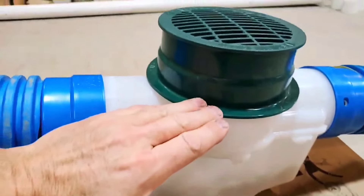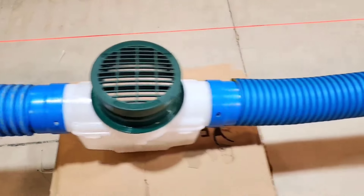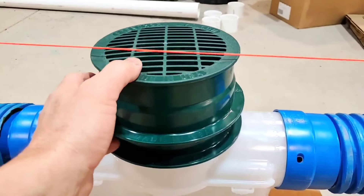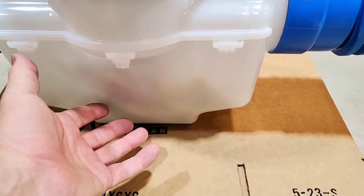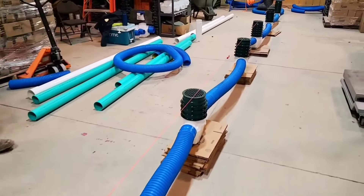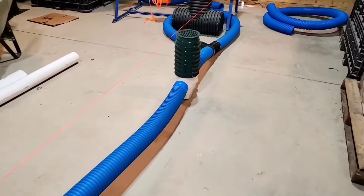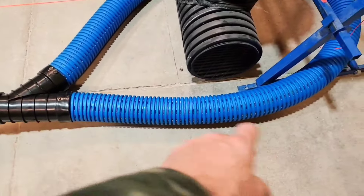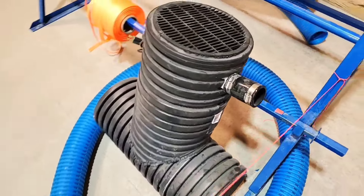This is how you're getting your slope — you have a flat yard and this line represents the height of your lawn. You've got water laying there and you're trying to get it out. You're dropping the water in the 6-inch inlet basins where you're collecting all the sediment so you don't plug your pipe, then running the water on a 2% slope. Right here you're discharging it into the sump pump area — perforated 8-slot, loop it around with a Y, right around your micro basin.